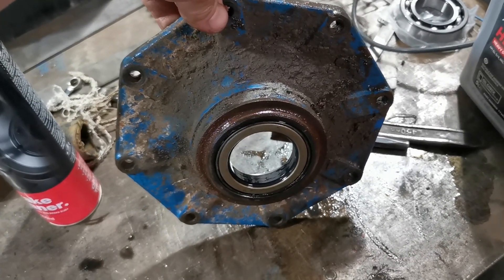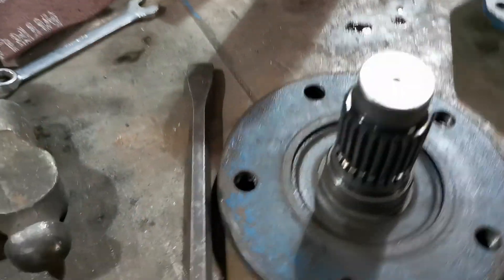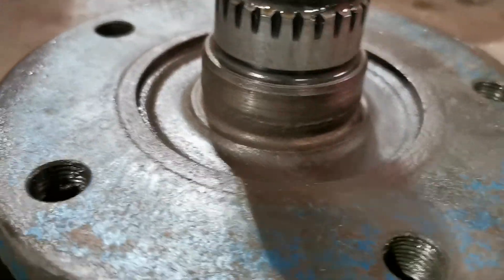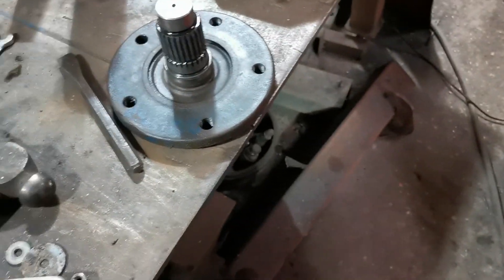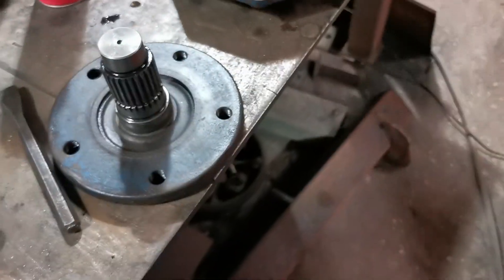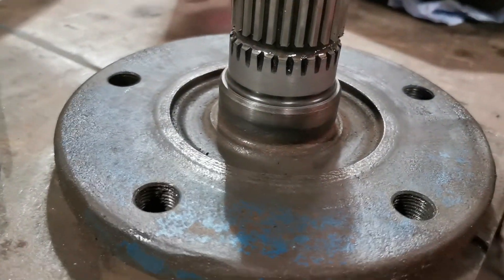Then hopefully we can get it back around to the slightly stricken three-wheel tractor, reassemble everything and get it working again. You can see it literally has a ring of bolts that holds it onto the drop spindle on the tractor. Next up for me is the hub here, which has an awful lot of pitting on the bearing seating surface — I'm going to get in there with the wire wheel on the grinder and clean that up so the bearing goes on nicely.